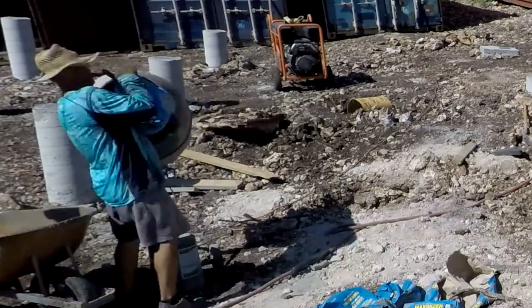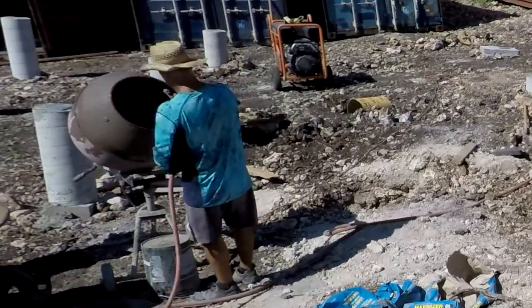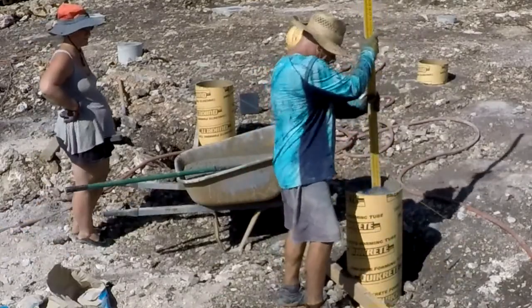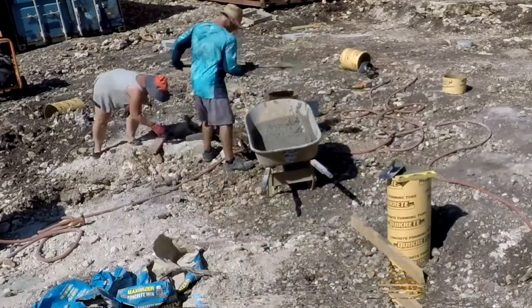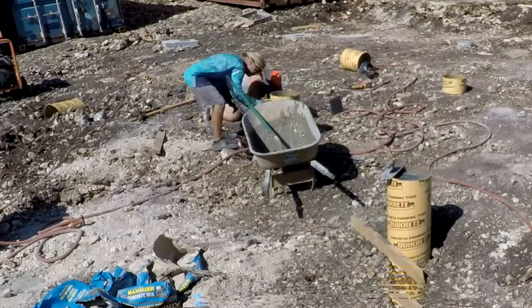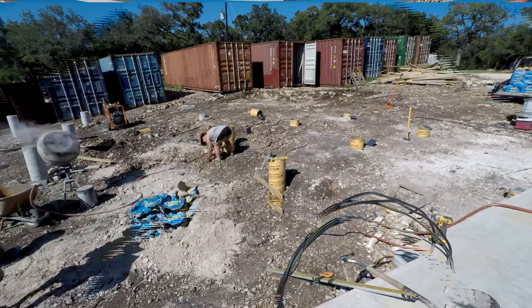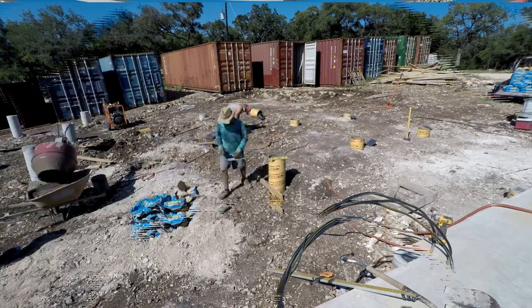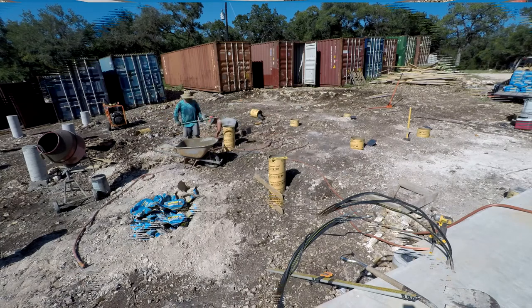The hard part is coming in the next few days — we're going to be doing our offices and our apartment, and those are three to seven or eight feet off the ground. I set the plate in after making sure the concrete is close to the right height, laser it again, then move on to the next one. We used maybe ten bags total for these six posts. We're a little bit over budget on the posts because I underestimated the number of bags needed, plus the number of sonotubes. Some holes are deeper than others. You see the truck there full of concrete — I have 12 more sonotubes sitting there that we'll be using for the offices and the apartment in the next few days.